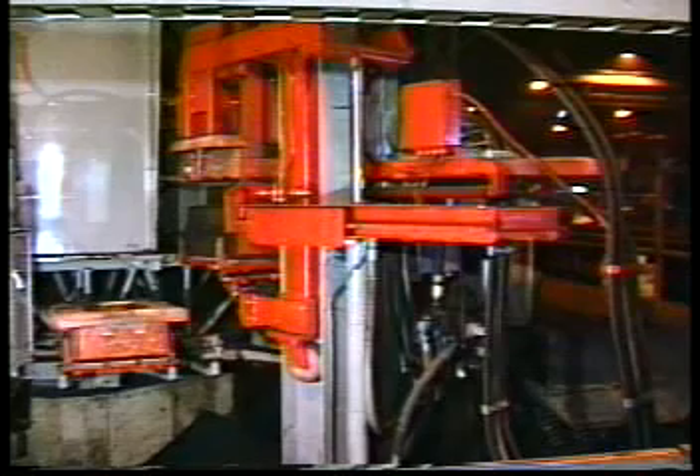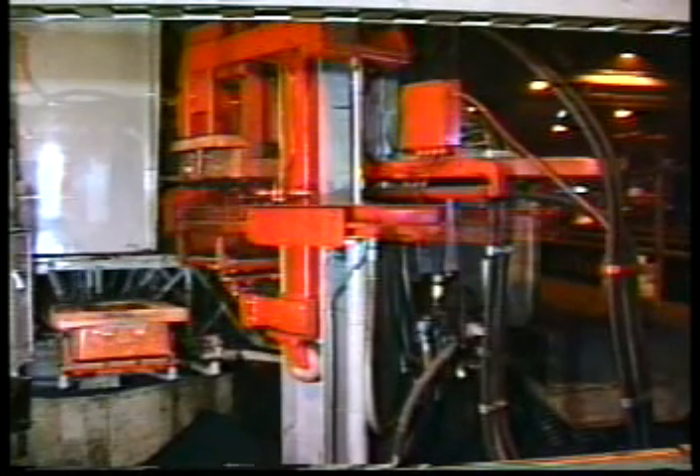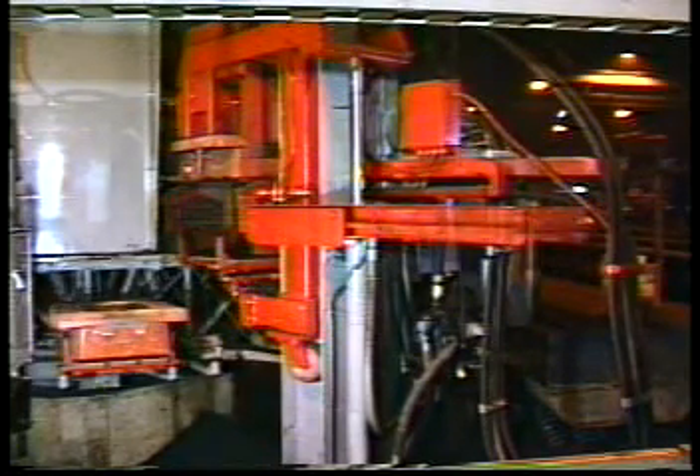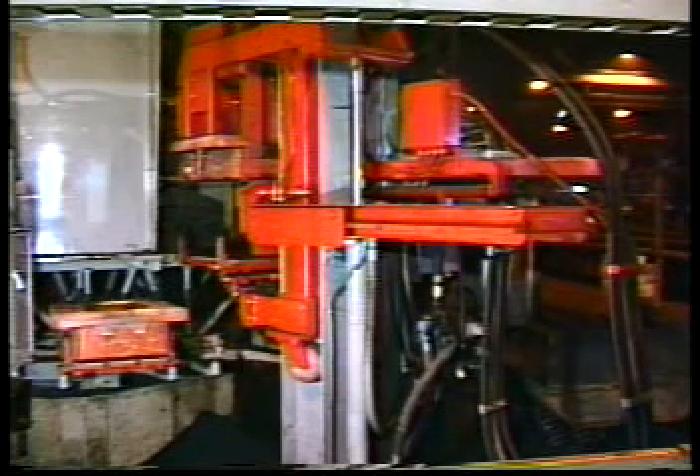After pouring, the molds cool under weights and jackets until they have completed almost one full revolution on the outer row of the table. The weights and jacket are then stripped and the molds are elevated and pushed into one of the cooling levels, where they will continue to cool undisturbed until discharge from the table.